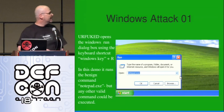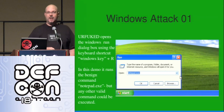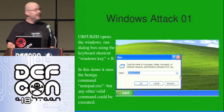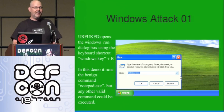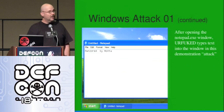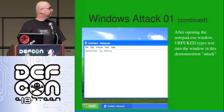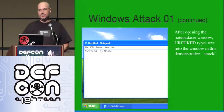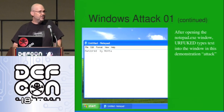This device pretends to be a keyboard, so it uses keyboard shortcuts and executes commands with the permission of the user. In this case, it uses the Windows key plus R to pop up the run dialog box, and executes notepad.exe. This is a non-malicious example, but it could just as easily be any arbitrary command. When that window comes up, it gets focus and is able to type in that window as well. You can run an arbitrary command and send it information — though you're doing this blind, since it's prescripted and run by the microcontroller plugged into the machine.